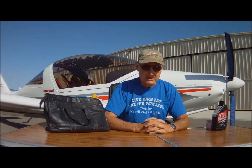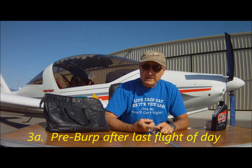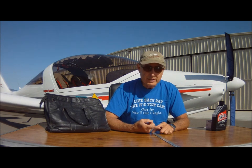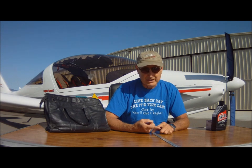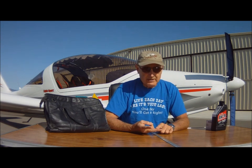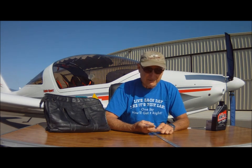Secret number three is to pre-burp the engine, and this can be done in two ways. One form of pre-burping is after the last flight of the day, 15 or 20 minutes later, you burp the engine. This may take 10 or 20 pulls, but you'll find that it greatly diminishes the number of pulls needed for burping the following morning. The second form of pre-burping is if you're not going to use the airplane for an extended period of time — try to get to the airport and burp it every day, as this reduces burping when you're getting ready to finally make a flight.